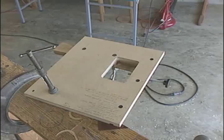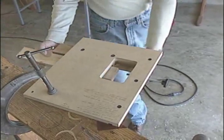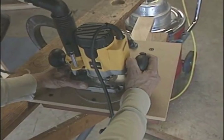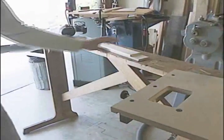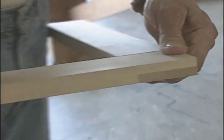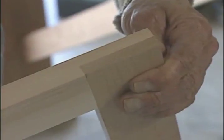Don't sand too much around the lap. You can quickly spoil the interface fit. Just brush the surface tear out off. There's no need to mark the next stick. Just index it to the screw and clamp it in place. Not a perfect fit, but not a bad try.